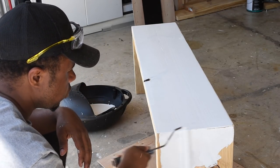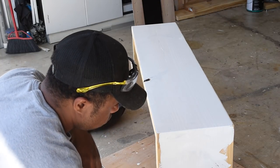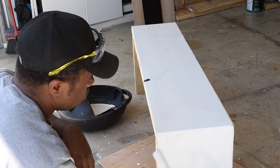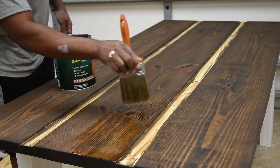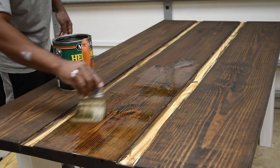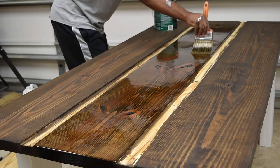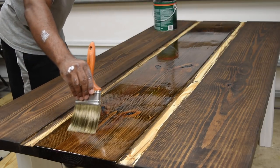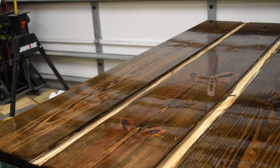For all the painted areas I applied an oil-based primer, and this stuff just sticks to everything. Rolling took a lot longer than I wanted because of the areas I had to reach. I really wanted to spray but I just didn't have the setup for the table and didn't want to spray some and not all. For the protective coat I'm using a spar urethane, which provides protection from the sun, rain, and moisture. It's much easier to use a broad brush to spread it on the initial coats, but on the final coat you want to start on one side and just drag it all the way out, then repeat that path until you're complete. This is coat one — I'll eventually put on two more coats.